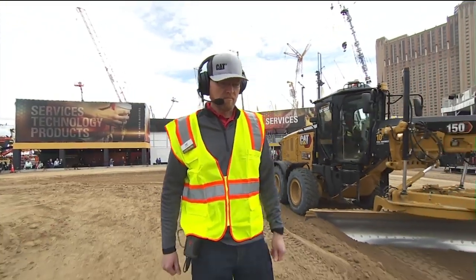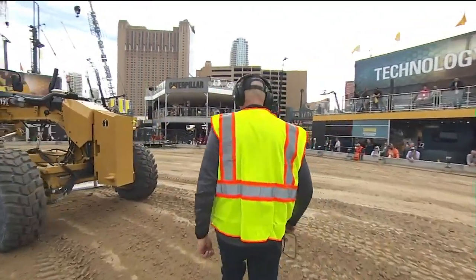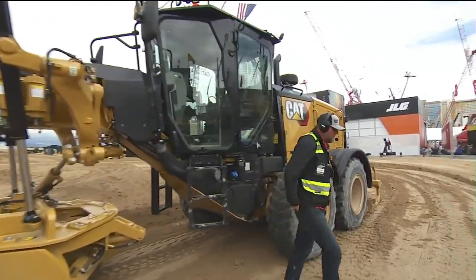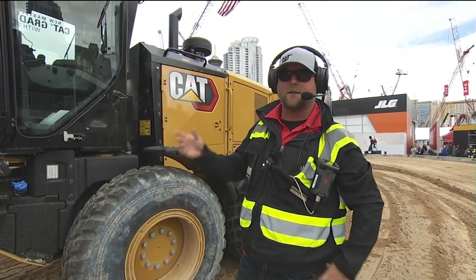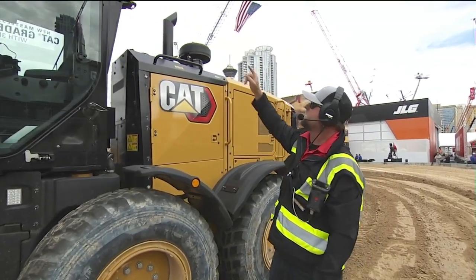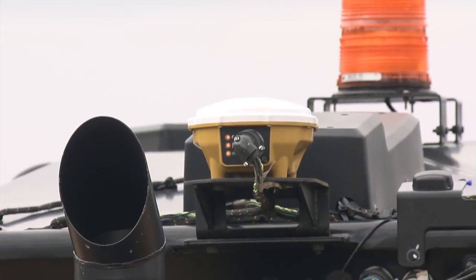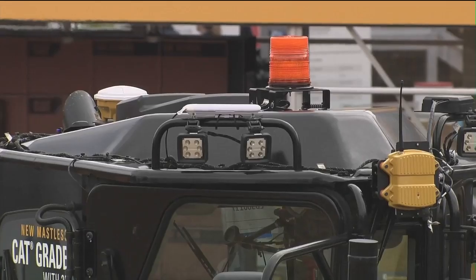While we're doing our five-minute cool down, let's take a few minutes — I'll point out what really makes this system work. This would be a great opportunity to do a quick walk around and explain a little bit about the GPS receivers and the sensors. I'll start back here, start high, and work my way low. We have a GPS receiver on the back of the cab, and on the front of the cab is our radio. Where Eric's pointing up front on the mainframe, that's our other GPS receiver. Having that receiver on the front of the mainframe, I can still look at my three lights and do some diagnostic checks if I have any issues with the system.